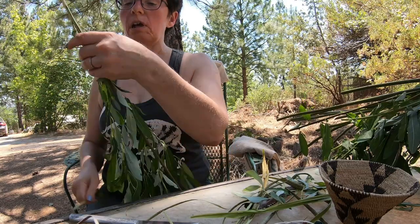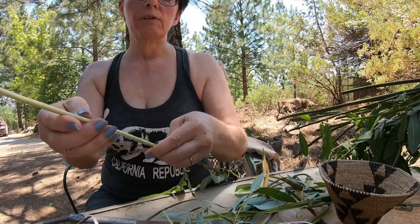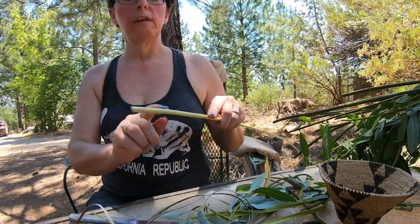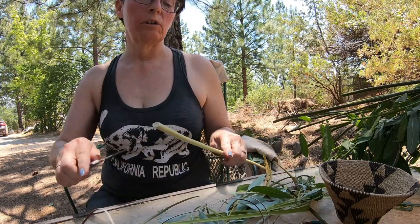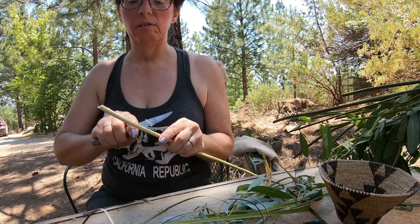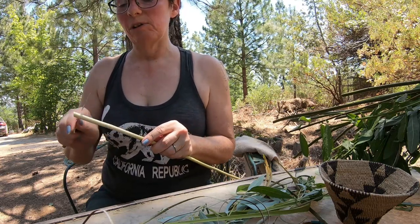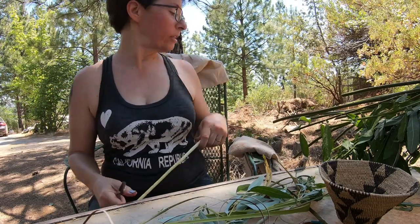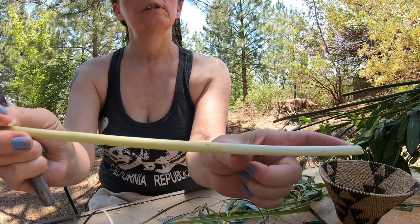As I get up to the little branchlets they break the flow. You can see how green this is — that green color underneath the bark directly is the sap. You're going to need to scrape that off or it will discolor your finished piece once dried. Now is the time to do it. This is one of those meditative tasks — you should slow down and relax. I lay it down and do it this way; you can also do it another way, it's personal preference. Start at the bigger end and work your way up.